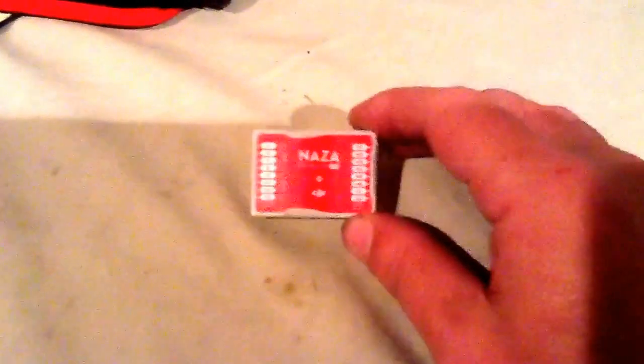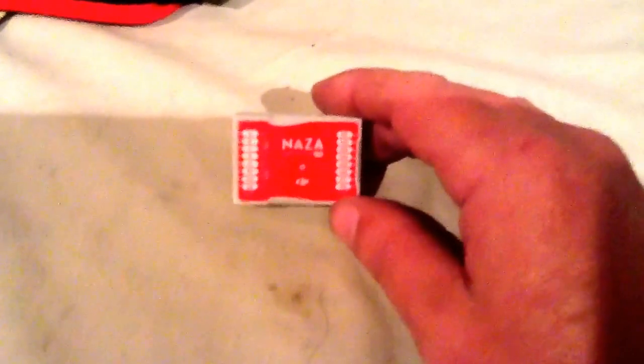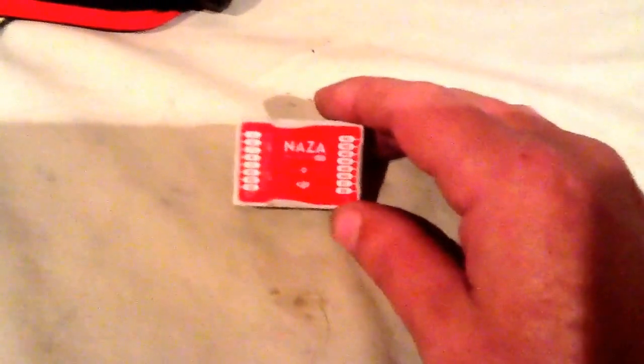Okay Brent, I wanted to make you this really short little video. You are having the same exact problem with your Phantom that I had with my HexaQuad at one time, and it was due to after it crashed. What's wrong with it is your accelerometer is stuck, and that's why it's doing that — surging the engines like it's doing.